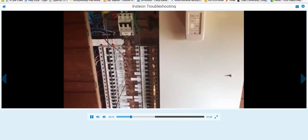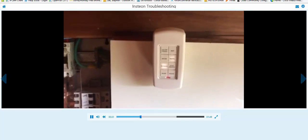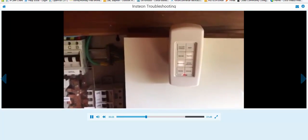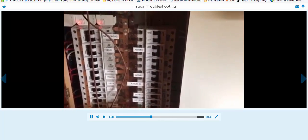What I've done is I've linked this keypad using the on-off button — I pressed and held the set button and linked it to a device in the house. Now I've got the distance button pressed and it should be sending commands to it and responding back. It should be a continuous beep instead of these error conditions. I need to find out what's causing that noise, so the trick is just go in and shut off a breaker or two in the panel and see if I can get it to stop.